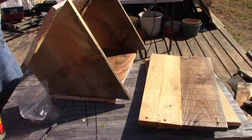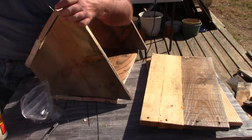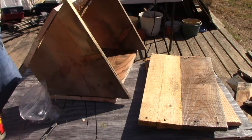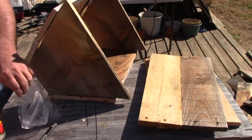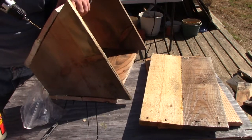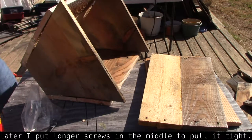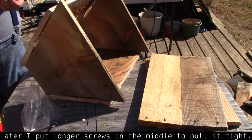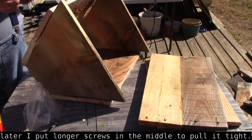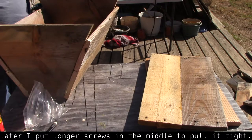Now the hives that I currently have out on my property, I didn't screw together — I used a nail gun to assemble them, which in all honesty went a whole lot faster. For those I used one-and-a-half-inch hot-dip galvanized ring-shank plastic-coated nails, which are exterior-grade nails for doing decks. Actually, they are the nails I used to do the deck on the cabin — leftovers. Let's get these last two in. And that's the basic design.